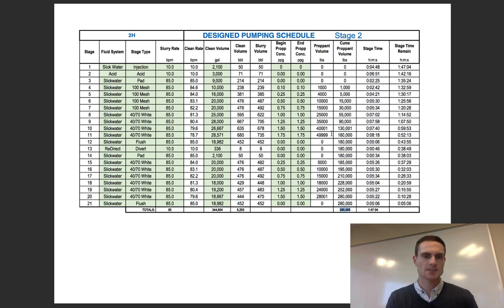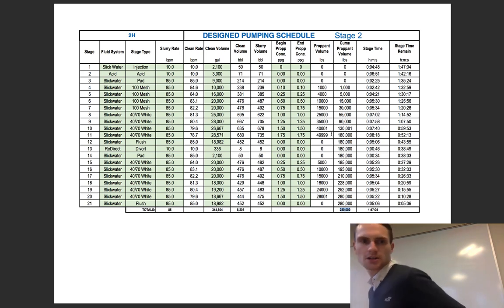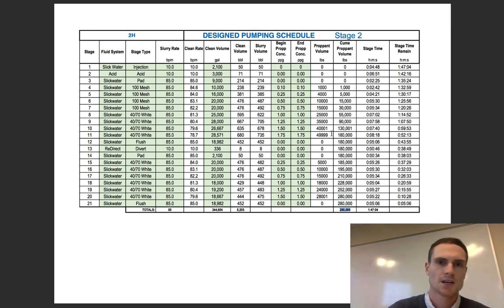In this case, they're running diverters. After they run so much sand and get far enough into their pumping schedule, they're going to stop and flush the well at the same rate — shutting off the sand to clean out the wellbore. That flush is probably about casing volume or casing-and-a-half volume of that well, so 452 barrels. They want to clean out that casing before running diverters; you don't want sand in your casing where it could settle and cause a sand plug or plug off the well.